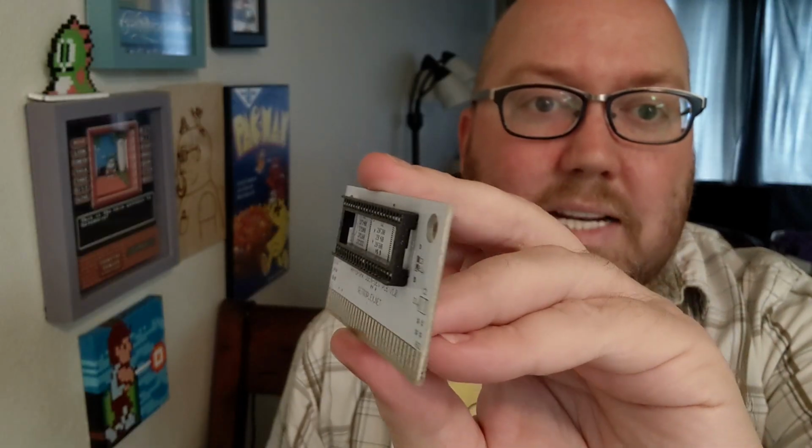And this here is a socketed circuit board that I made. You can get your own parts. These shells are available through Muramasa's website. You can get them through Mortov online games or something like that. Just search for Mortov. Muramasa has these as well. But then also get these socketed EEPROM boards, because that way, if it works, it's just to test it out. And it works. Great. Then I can take this out and put it onto a new board and solder it into place permanently. This is just a test to see if it works. I also use this in lieu of an EverDrive. So I was like, man, I want to play that one game. I can put the game on here, play it, play through it, beat it, erase it, put something else on here.